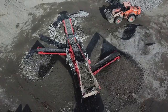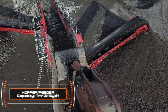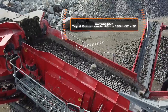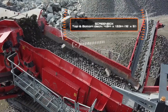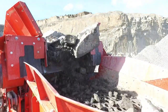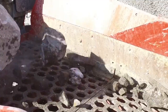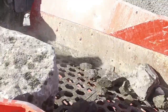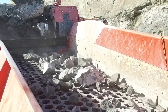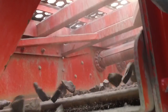The heart of this new model is the new triple shaft screen box featuring two true full size 16x5 screen decks. The triple shaft design of this new screen box employs an oval motion stroke to generate an aggressive screening action. This reduces plugging and blinding over of the screening decks to ultimately provide quality product with high tonnage output. The aggressive screening action with a larger throw on the screen box makes it ideal for fine screening a diverse range of materials.